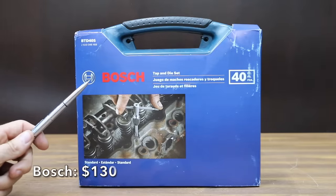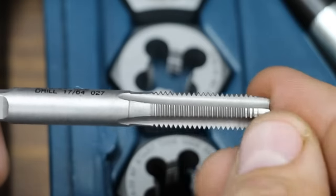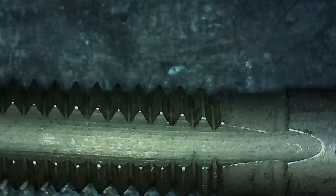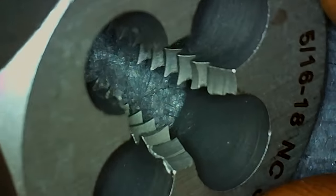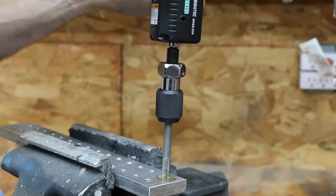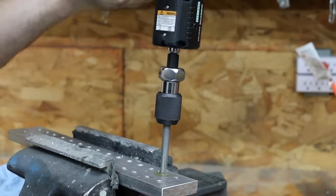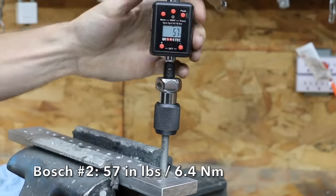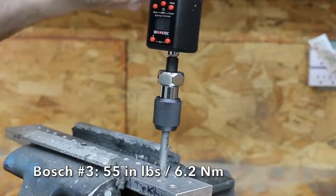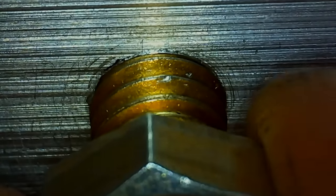At a price of $130 is this Bosch 40-piece tap and die set. It features rolled threads for more accuracy and cleaner cuts than machine threads, and heat-treated carbon steel for superior durability and speed. It's commonly used for threading rods, bolts, and studs. The Bosch is made in China. The tap weighs 21.32 grams and the die weighs 26.34 grams. Tapping the first set of threads required 70 inch-pounds—about the same as the Tecton—then 57 on the second hole and 55 on the third, for an average of 61 inch-pounds. The amount of side-to-side movement seems slightly better compared to the Tecton.